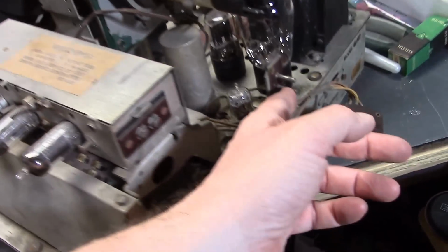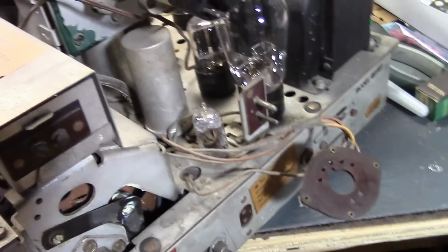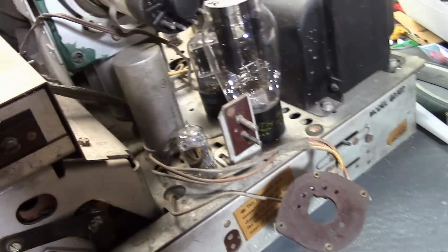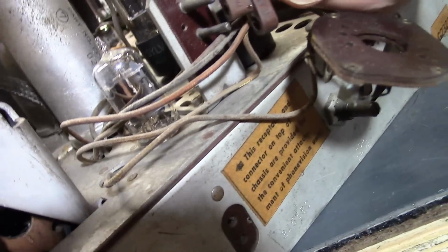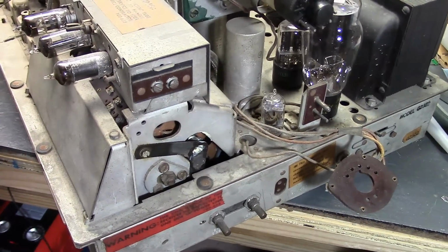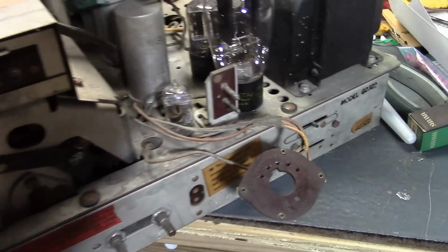The AC interlock is a little odd. It's polarized, apparently. Locks into the back, so I'm going to have to rig something up. My normal cheater cords will not fit under that. I think the spacing might be a little different. I certainly have polarized cheater cords, but let's see. The spacing looks a little wider. Yeah. If need be, I can just cobble together a connector with a power cord. Just use some brass tubing or some push-on Molex connectors or something. I'll rig something up.